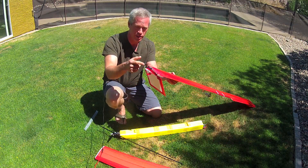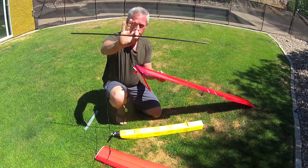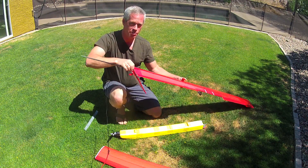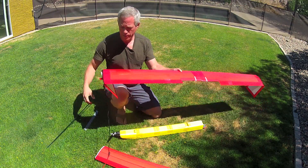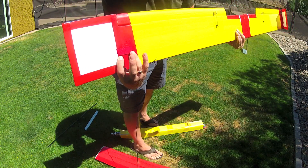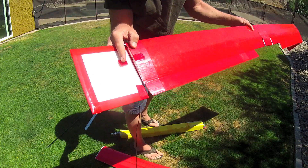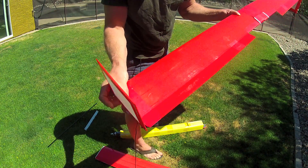One carbon arrow shaft serves as a spar and the other one is a pusher to install the spar into place. You can see this protruding here — that's just pushed in. I grab the pusher mid-span to push the main spar into place into the wing in this central location. Then the vertical stabilizers are deployed. There's Velcro originating from the lower surface of the wing; it goes through the vertical stabilizer and passes through the side, and that is engaged like that.